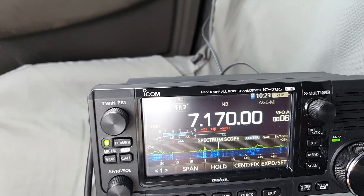There was a good solid couple of S-points in that, maybe a bit more. So I'm going to wrap things up here. I'm really happy with the testing today — both antennas tuned in, the matching network seems to work, it's certainly not affecting the match, the SWR is good, and we are getting some front-to-back. Not a whole lot of stations to test it on but I got a French station and one in Switzerland and there was front-to-back. There's a few others not on video. A few S-points difference. I made one QSO with a G6 station earlier.